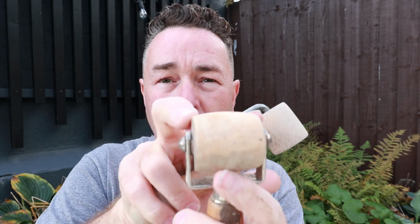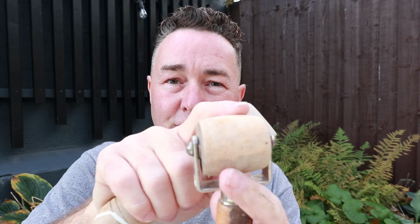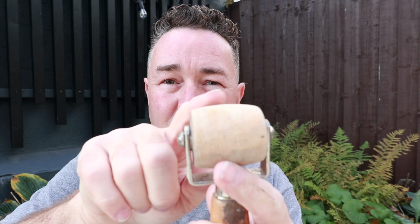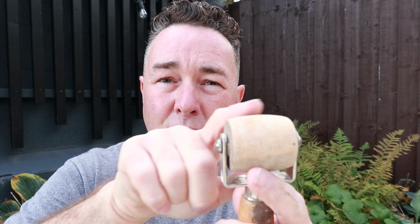Right? So you can appreciate that the weight distribution as you're pressing that down isn't in one spot, either one side. It's not in one, of course it's in one spot, but it's not putting the full pressure of the whole width in one spot. You can use it from that side to the other, moving it around. And also your highlighted part is where it's pressing down. So if you use that highlighted over the barrel, I call it highlighted, where it's raised, you're not putting side pressure on to press into wallpaper. That's why I use a barrel seam roller.